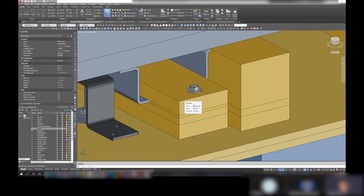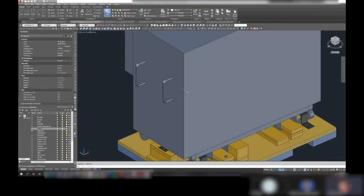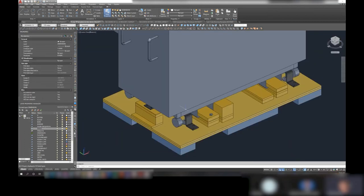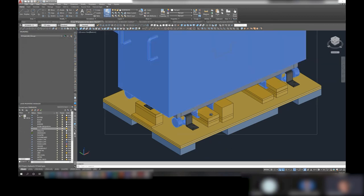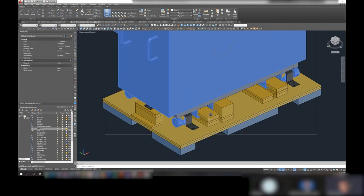But if sometimes you go and measure on site, imagine what will happen when you are doing your actual pack, because sometimes the measurement is so ideal. I mean, I sketch it so ideally, because sometimes the cover will protrude out a lot. You are unable to measure so accurately that you can calculate the hole points. That's why normally we will use lag screw on site.